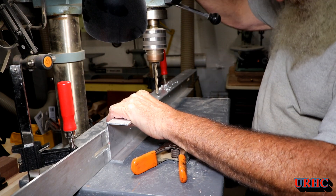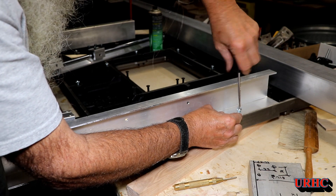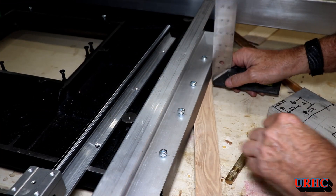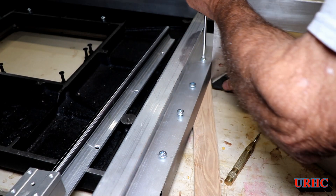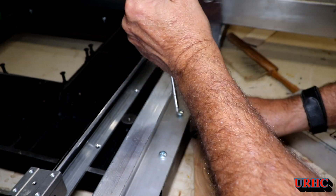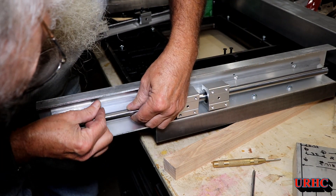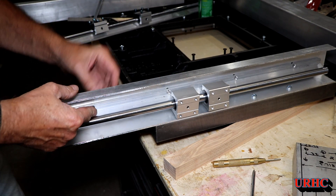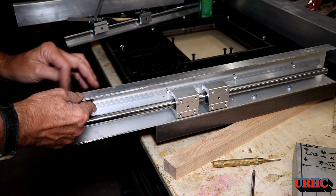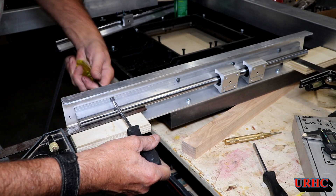I'm drilling the holes to mount this bracket up underneath the table. It's using M6 threaded holes that were in the base of the tabletop on the bottom side — they were originally for mounting a fence. To start out I'm getting it parallel with the outside edge, though it's a little off from side to side so I'll be fiddling with it later. The linear slide blocks go in there — they're 16mm diameter shaft with full ball bearings. I was surprised they came with really nice shaft wipers and seals, and they'll be down out of the way where dust shouldn't get into them.